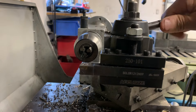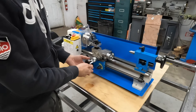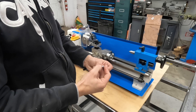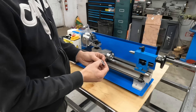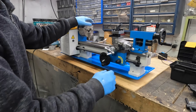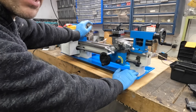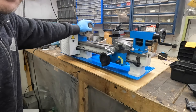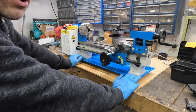As I've already mentioned, these handles don't have any good way to tighten them — there's no spot for a wrench and no spot for a screwdriver. For this reason, this is the first thing that people build with their new mini lathe. We are going to use this lathe with the rubber feet installed, but ideally you would actually have this bolted down to a bench or a piece of plywood or something. As you guys can see, this thing is not very stable, so I would advise that you bolt it down securely before using it.